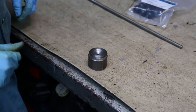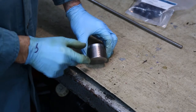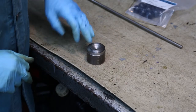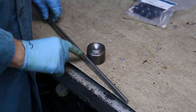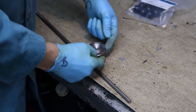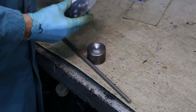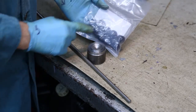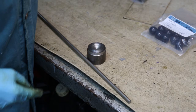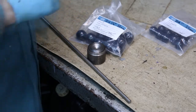The first thing I found was a piece of mild steel bar, two inches in diameter — that's 50mm — and it's about 37 millimeters high, which is an inch and a half. I'm hoping that will make a good hub. I also found a piece of bright mild steel bar, nine millimeters in diameter, which should be good for the branches. I also found bags of Bakelite handles: one bag has inch — 25mm — diameter handles, and the other bag is an inch and a quarter or 32mm. I suspect the smaller handles will look better.